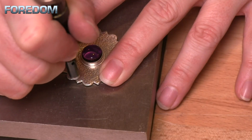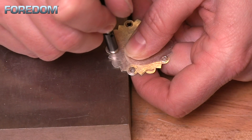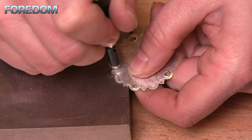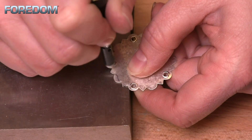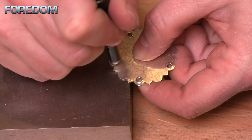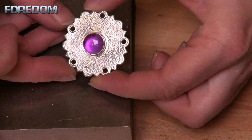On this piece I have two rivets that I've put into place. I'm going to use the altar head to just gently go around the rim of each rivet to push it over and flare it out. This has been pre-flared, so really all I'm doing is burnishing out those edges. It doesn't take a whole lot of pressure, but it rolls the edges quite nicely. The hammer handpiece does not actuate until I give it some pressure, which is handy because I can get it right where I need it before allowing the pressure to begin and laying it down.